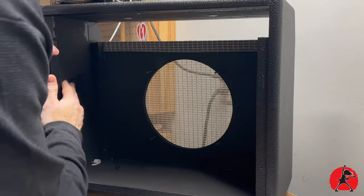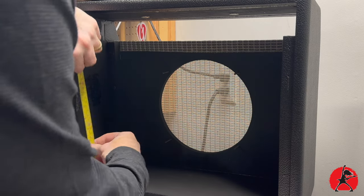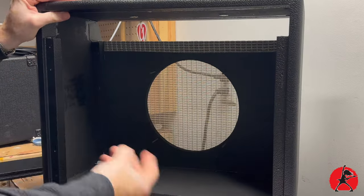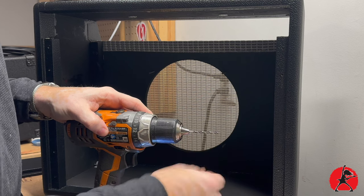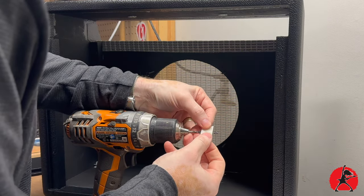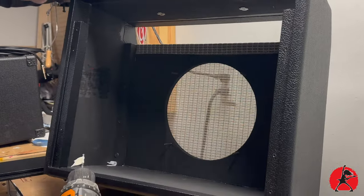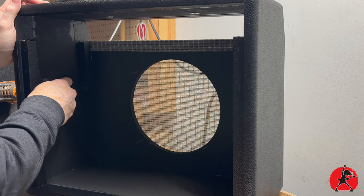It's funny because there's already some kind of a sticker here in this location, which they could have put in a different spot, but it's there, so we'll leave it. So eight inches up — it's about here. It's always a good idea to drill a pilot hole first, because if you don't, what's most likely going to happen is the pine will split. We should drill a 5/64th hole there. We only have to go in about a quarter of an inch, so I'm going to put some tape on the edge of the drill bit to mark the depth. We don't want to overshoot it. And we'll just drill a hole here and screw that in right there — that's all it takes.